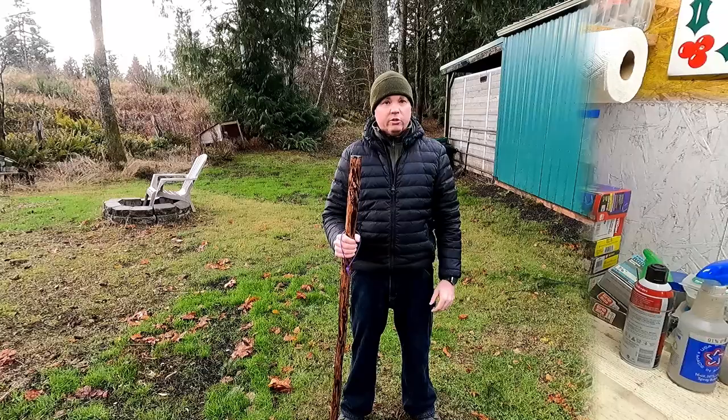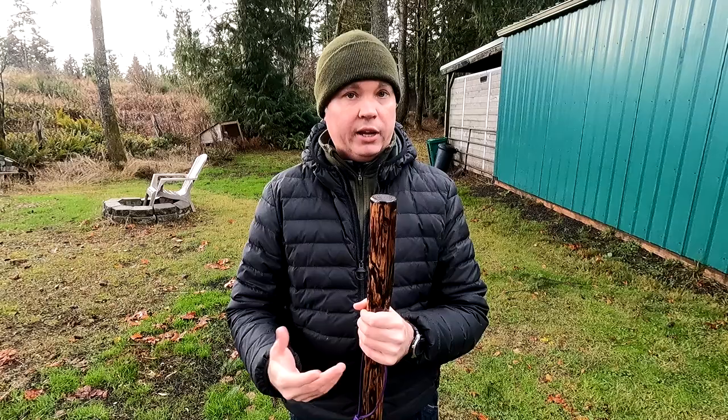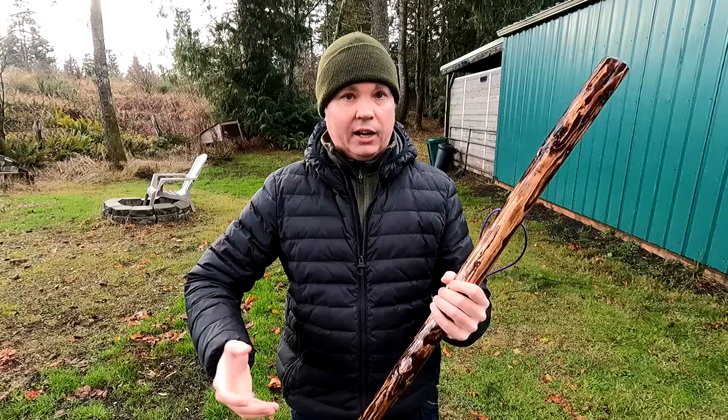Here's the final product — this project is officially done. I brought it outside so you can see what it looks like in daylight. I'm pretty happy with the results. I will say that I used a pretty thick piece of wood for this walking stick, thicker than I normally use, but with the added weight it also brings some versatility — you could potentially use it to build a survival shelter or fend off a wild animal without worrying about it breaking. I did use some special tools: a draw knife, a couple of belt sanders, and a drill press, but you could get the same results with simple hand tools — a standard drill, a knife to debark, and hand sanding. It would just take a little longer. I hope Janet likes it — thank you for watching.